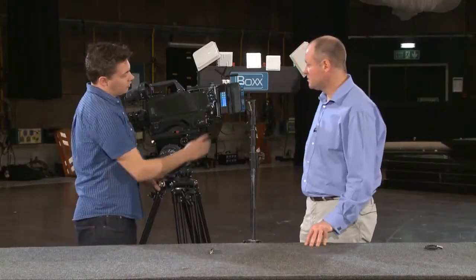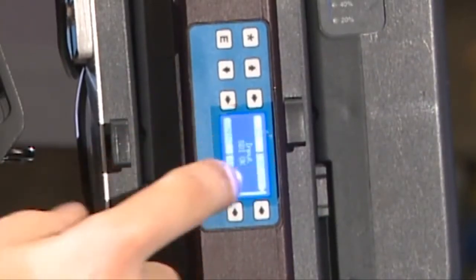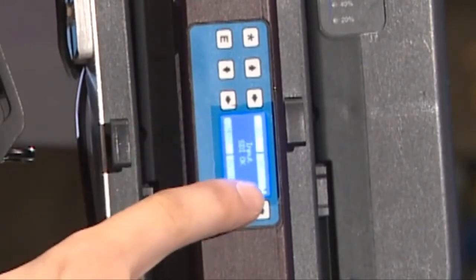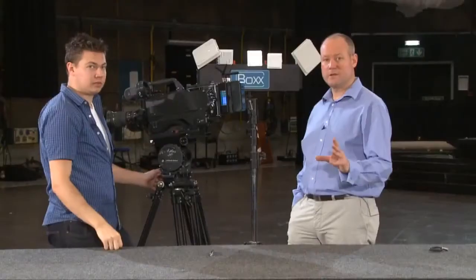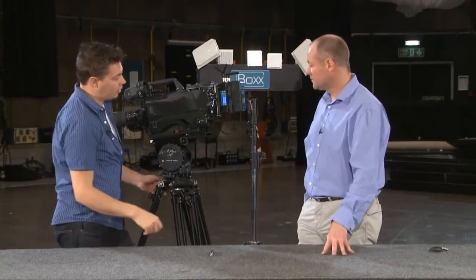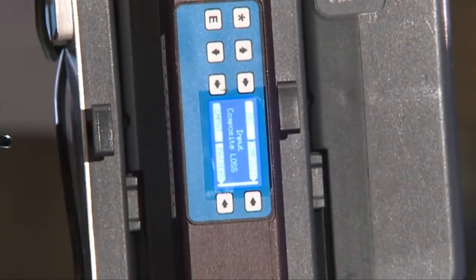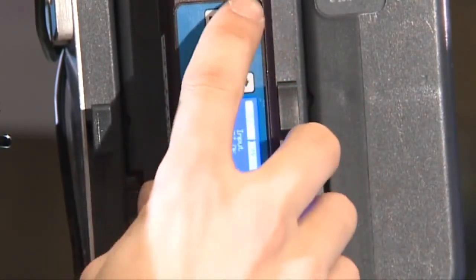To get into the menu, just press the E button up here. The default menu that comes up is the input selector — at the moment we're on SDI so we've got 'SDI OK'. The four options are SDI, Composite, Component, and there's a built-in test pattern within the transmitter as well — that's a 720p test pattern, so make sure your equipment can see a 720p signal if you're using it. To switch, press the button relevant to your choice. It will say 'composite loss' if no composite signal is connected. Switch back to SDI for 'SDI OK', and press the star button to exit the menu.